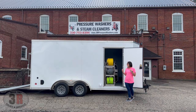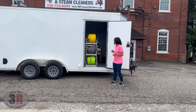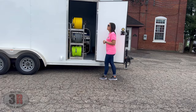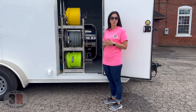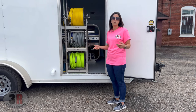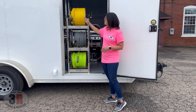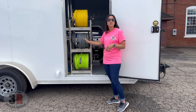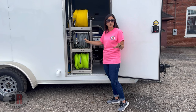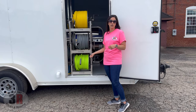Starting up front with the hose reels, we've got three of the 12-inch Titan hose reels with the stainless steel manifolds. The Titan hose reels are made out of aluminum, so it makes them a little bit more corrosion resistant. The top one is holding 200 feet of the 1/2-inch soft wash hose. The middle has 200 feet of 3/8 pressure washer hose. And then at the bottom we've got 3/4-inch Flexzilla garden hose.